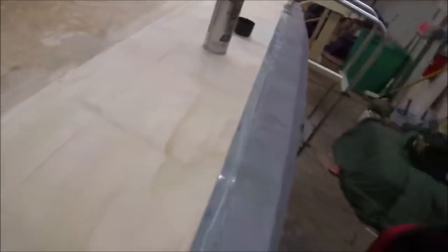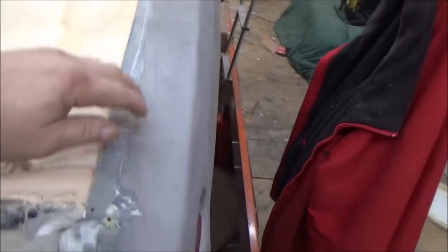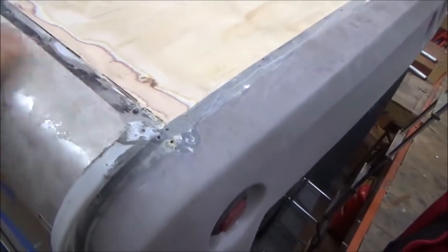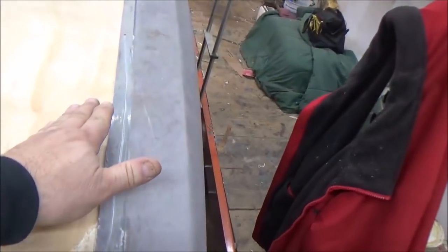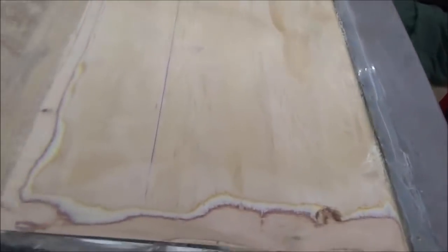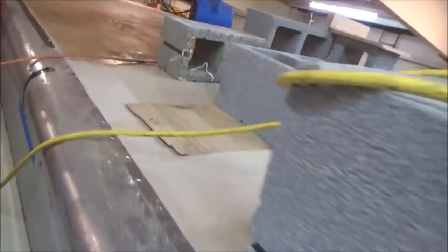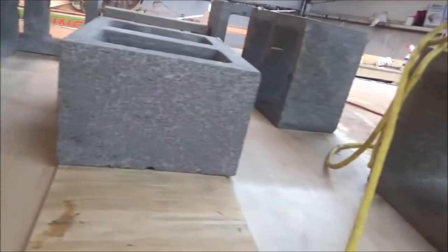So we showed you on this lap in the last clip — we had such a gap in there I didn't like it. What happens is the company that makes these molds, if they don't keep them clean, they don't line up and they get bigger and bigger. This particular one tapered down really bad, so I want to build it up so we can get water to run off and not just sit in that little area. We put this piece on here, layered it all out so the roof will come right up onto it. Over here we had a little bit of rot we were trying to dry off — we didn't like it so we said the heck with it and put a new piece down. We epoxied it back in.